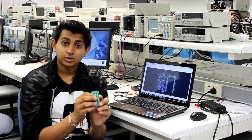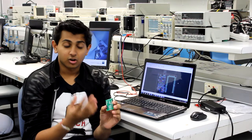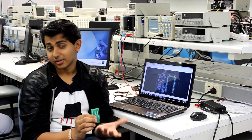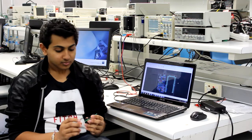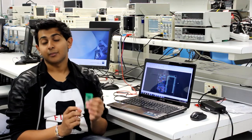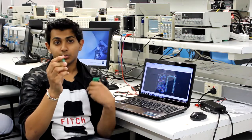As you can see, it contains a transistor that allows us to switch our dribbler on and off depending on whether we need it or not, and a motor driver which allowed us to control both motors simultaneously quite well. This PCB is the exact same size as the IO, allowing the IO to sit directly on top and allow us to have more space on the robot for other stuff such as batteries. The good thing about this PCB was that it also contains extra ports for analog and digital outputs, allowing us to use extra sensors designed on these breakout boards to do more features such as wall detection and other stuff.